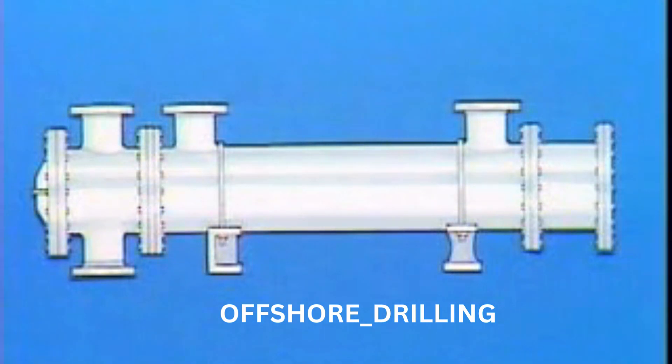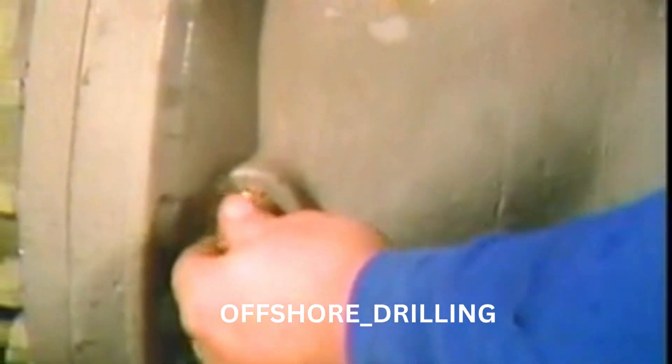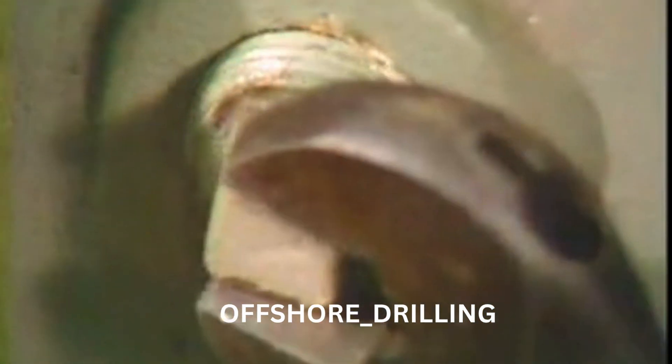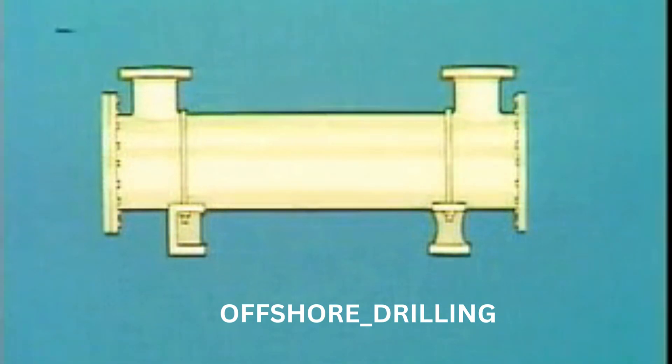Over to the heat exchanger. It consists of cooler tubes through which the raw water flows from one end to the other and back — engine water flows around these tubes to lose some of its heat then goes back into the engine. Located in the headers at each end are zinc electrodes. They prevent electrolytic action on the tubes which would cause corrosion and a hot engine. Any deterioration of these zinc electrodes means electrolytic action caused by externally grounded electric currents — this must be corrected to avoid serious damage. If the electrodes are 50% or more deteriorated, replace them and find the cause. To clean the heat exchanger, remove both header covers and use a pressure stream of water on the inside and outside of the tubes. Passing a round wire brush through the tubes will be the most effective way to clean them.